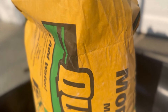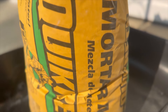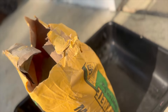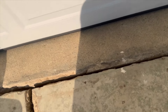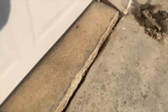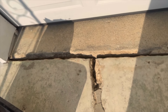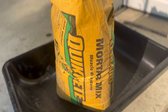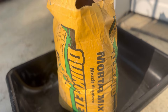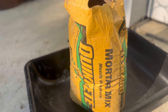If you've searched concrete on YouTube within the last several months, you'll know that most of the videos popping up are about dry pouring. We're going to give it a shot today. We've got a pretty large crack to fill in between my garage and my landing out front. The mix I picked up is made by Quikrete — just plain old mortar mix, nothing special. I paid a little over six dollars for a 60-pound bag.